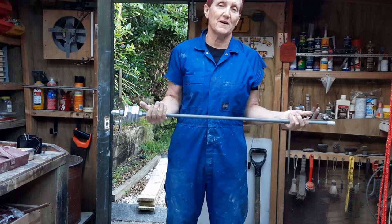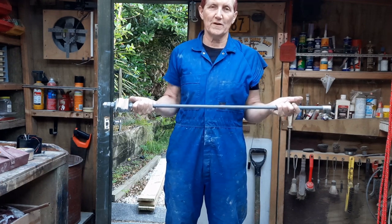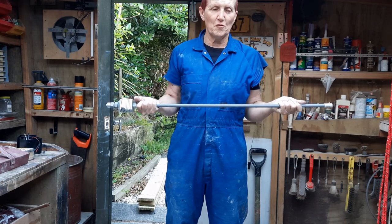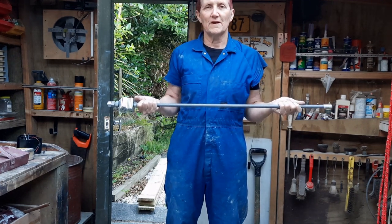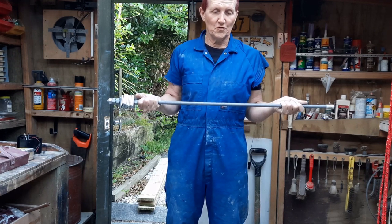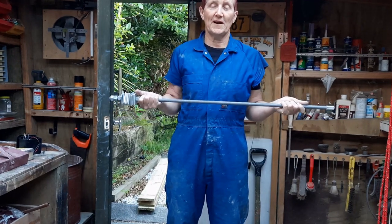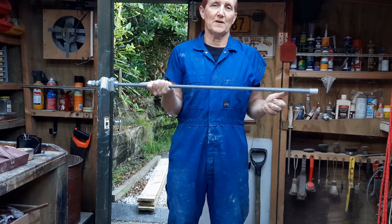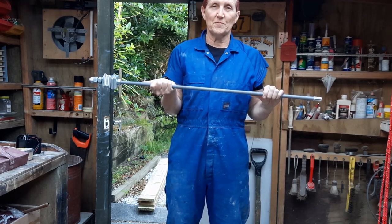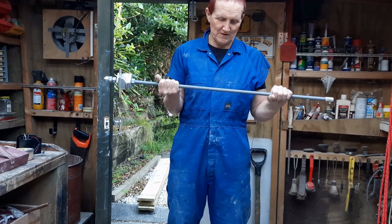So I had planned to do some digging, but this stuff needs to be done, and I think now's the time to do it before the hole gets too deep. And I've got a bit of a new plan around the shoring side of things, moving on down. That'll be using 50 mil by 200 mil H4 treated wood. Again, it'll be easier to show you rather than trying to explain it, but what I've got planned is going to be pretty robust, so it should allay any fears of a collapse.